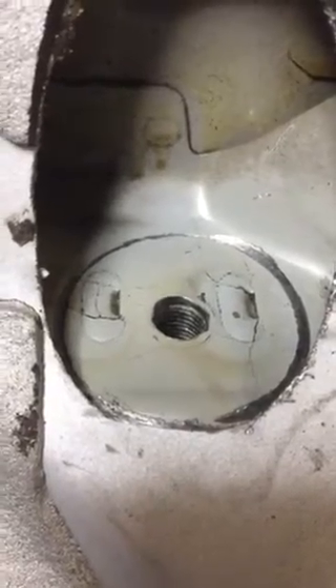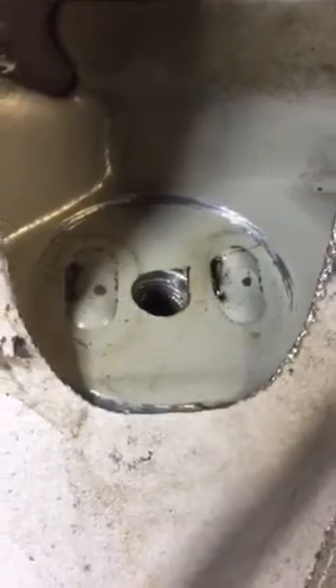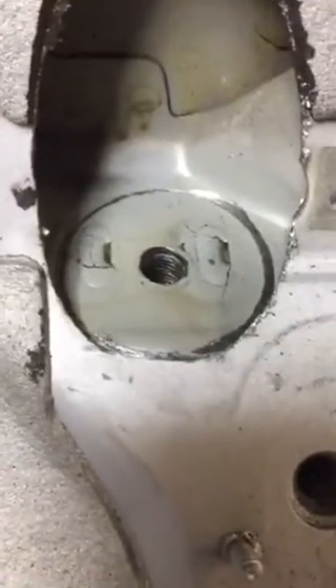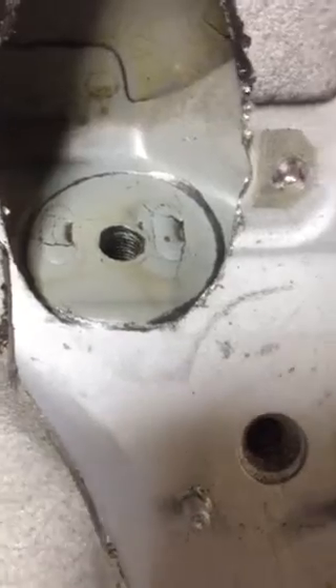That's the right side, and this is the left side. On this particular car you can see the left side is also cracked, which is not uncommon, but it's not very common on a car with this kind of limited damage. This car has been driven without the V-brace that helps support the subframe from lateral forces, which I believe further proves my point.